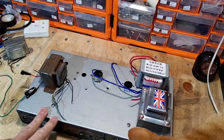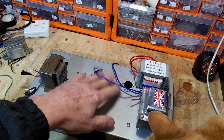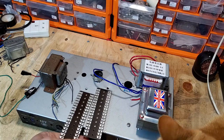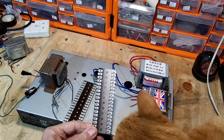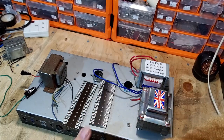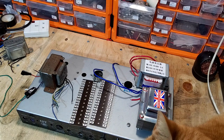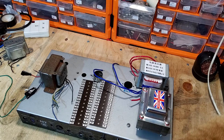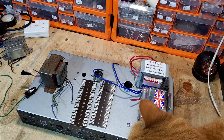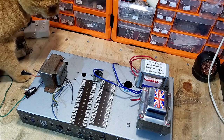Although if you look in one of these, you've got this huge PC board, all the tubes, the tube sockets are underneath it, and I don't want that, that's useless. So we're going to use these, which are the Vox AC30 type terminals, and you can see those there. Pink's just checking it out, make sure it's in good order. So we're going to use a couple of those, and I've drawn a schematic out for this amp, which we'll take a look at. So I've kind of brushed a schematic up to give me an idea of what I want in this amplifier.